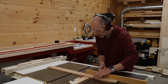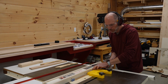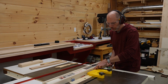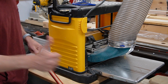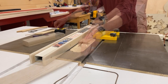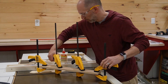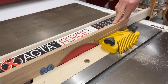Now I can start making the actual block part of the stop block. I could just create a simple square block, but I want to amp up the design a bit. So I cut a piece of white oak to just over 20 inches long and start to make a spline that keeps the block centered in the T-track. I plane the spline down until I get the perfect fit, and then cut a matching groove in the bottom of the block, making repeating cuts and flipping the board around each time to keep the groove centered. After gluing and clamping the spline in place, I realize I only need it to be in the first 8 inches of the block, so I take it back to the table saw and trim off about 12 inches of the spline.